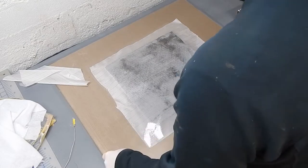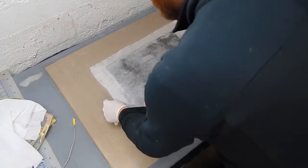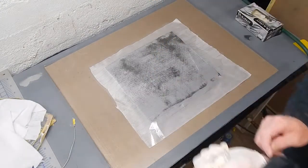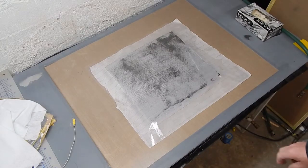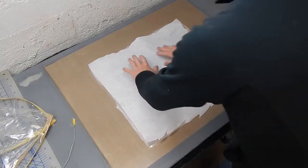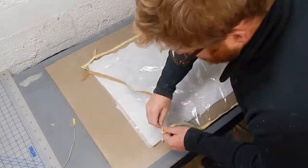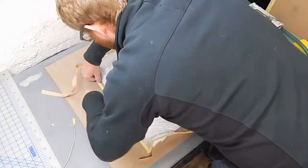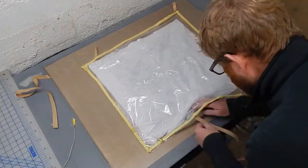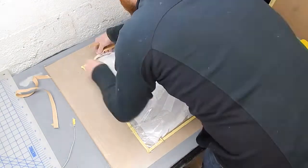And so this is, I think, P3 perforated film. It's clear. It's a different material than I've used in some of the other samples. And so now I will come back with my breather, my gloves off, and a vacuum bag that is a little bit too small. If you've watched any of these before, you've seen me vacuum bag an awful lot, and so I'm not going to dwell on that here.